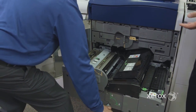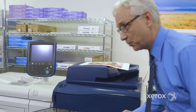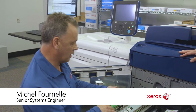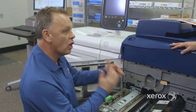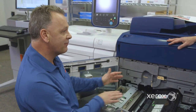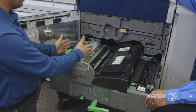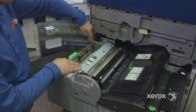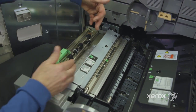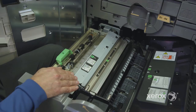One of the biggest things is IRA, Integrated Registration Alignment. How does that happen automatically on the press? When the machine leaves manufacturing, we have a baseline — the mechanical part of the machine is a known factor. Every piece of paper, every type of media reacts a little bit differently in the paper path. The paper enters the pre-registration area, which is called IRA. It uses multiple sensors in the device, and the main one is the CIS here. Paper stops, and at that point we measure many locations of that paper, and all this information is recorded and sent to the controller.